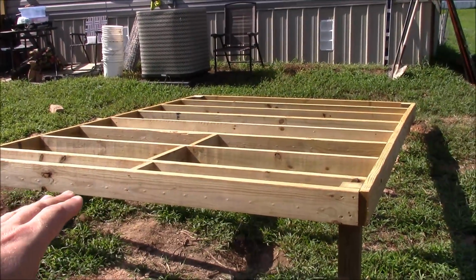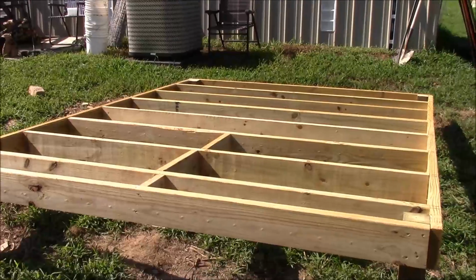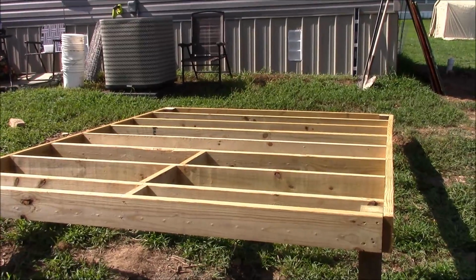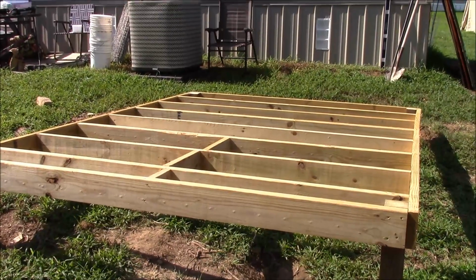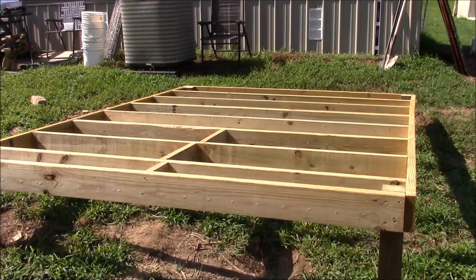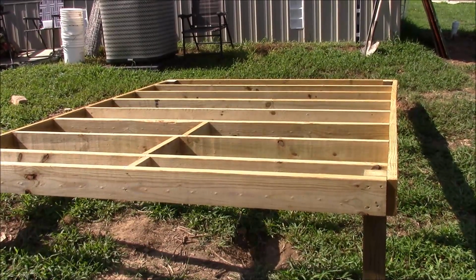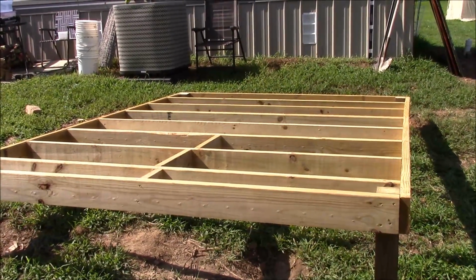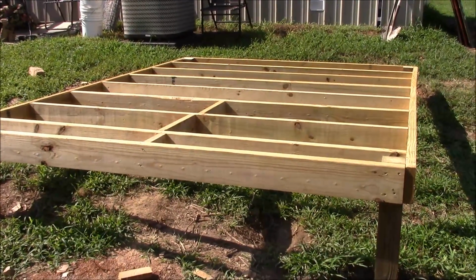And so there we have it. This is the basics of the deck, and we've got some 3/4 inch OSB that we're going to be putting on there and screwing down on there. And I'm a firm believer in using ceramic coated T25 3 and 3.5 inch framing screws. It's just quicker and easier a lot of times than trying to use a nail gun or even, you know, driving hand nails. Screws, as long as you don't strip them out, will hold very well, quite a bit longer, with the caveat that you don't strip them out.